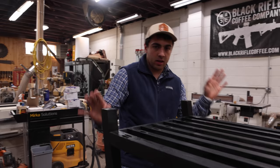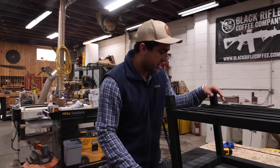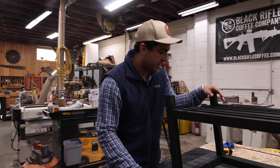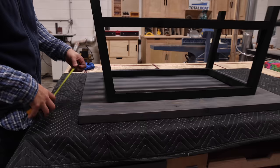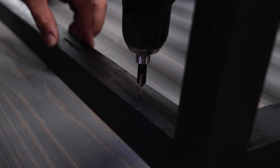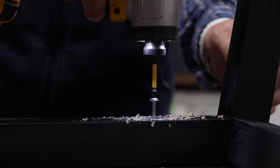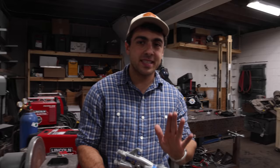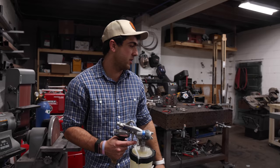Update: we finished Friday, I put stain on it, let it dry over the weekend, and came in this morning — the stain on the top looks great. Now I'm gonna attach the base to the top with some screws through the skirt, and you could also add some on the side skirts. I'm centering the base on the top — should be four and a half inches on each side. Last step: I'm gonna hit it with some lacquer. They sell lacquer in rattle can form if you don't have a fancy machine, but this will help protect the coffee table over its lifetime from coffee mugs and whatnot. Let's spray.